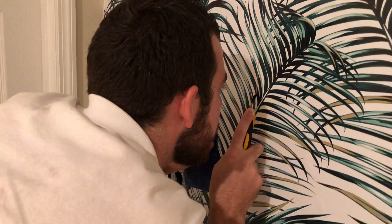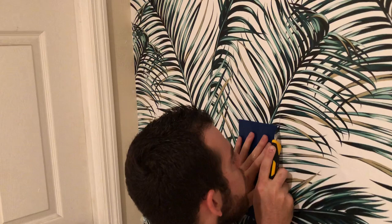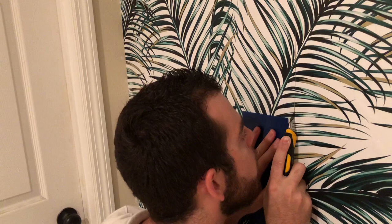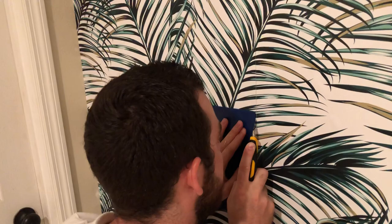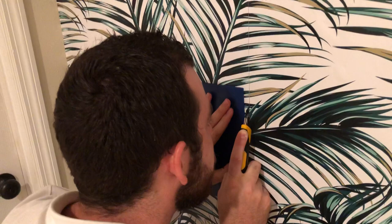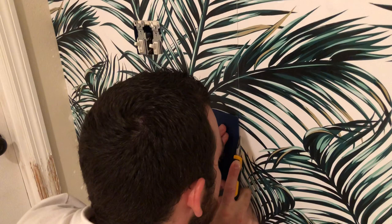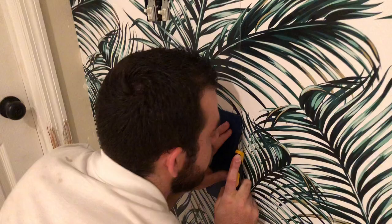What he's trying to do is make the cut right on the edge of the wallpaper that's overlapping. The sheet that he's penetrating is the sheet underneath it. The sheet against which the blade is riding is the one to the left. So if we make them meet, we've got a perfect seam. That's why he's not using a guide — he's actually freehanding it using the edge of the overlapping wallpaper, which is straight because we've made it all plumb. He's using that with a very sharp 18-millimeter blade with an OLFA knife in order to make this cut.